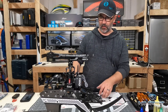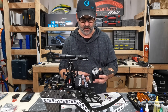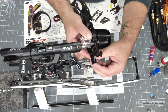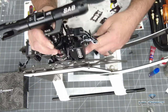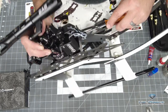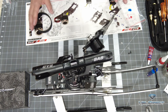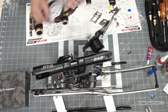Next up, we're going to work on installing our motor assembly here into the main body. Essentially, if you look at the motor mount, there are two posts with lock nuts and washers — these are going to slide into two channels in the frame on each side of the main transmission plate. Then we're going to take these bolts and go through these channels into the side of the motor mount. We're going to leave all that stuff loose, then put our motor belt on, set the tension for the belt and the motor, and then tighten everything down.